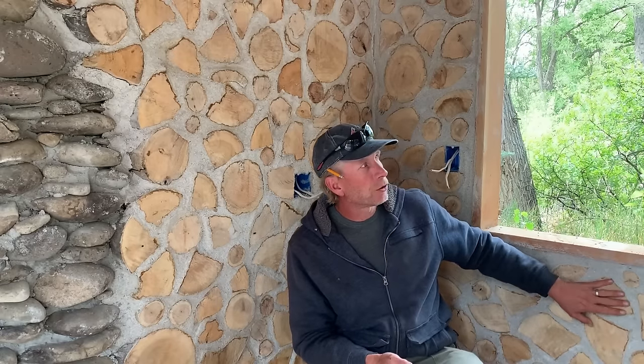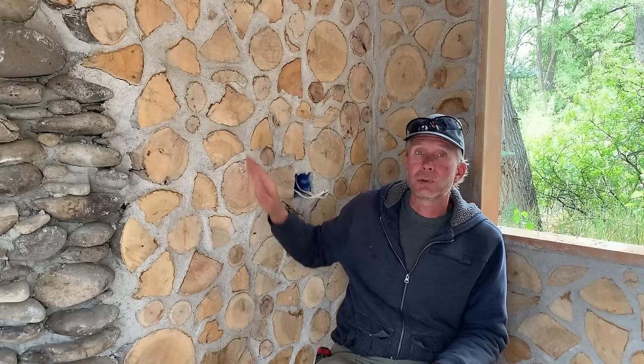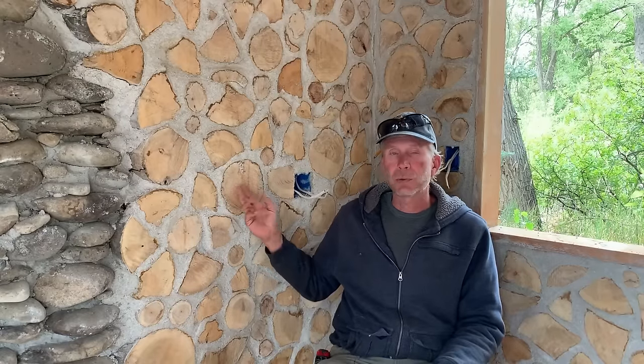The advantages of it are, of course, the beauty. It's really nice to look at. The fact that it satisfies those two most important considerations in energy-efficient building, where you have both thermal mass of the stone product that is going to hold and radiate heat over time, and the insulative value of the wood. So though these walls are not ridiculously insulative, at the 9-inch thickness that I'm setting them, they should have about an R12